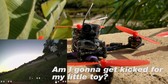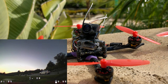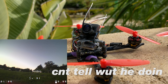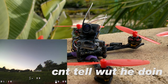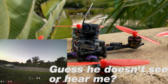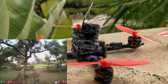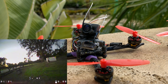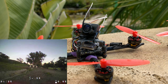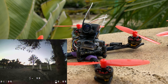However, 2S performance is just so much better than 1S. On 1S you just don't have a lot of throttle feel. When you move up to 2S on even an 0803 or 0802 motor it gets a lot faster, but your all-up weight also goes up to about 65 grams. On an 0803 or 0804 motor it's still pretty safe on 2S, but once you get up to 1103 on 2S it starts getting really powerful — like really powerful.